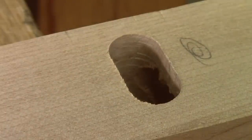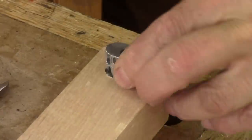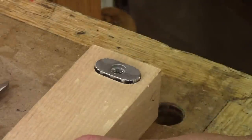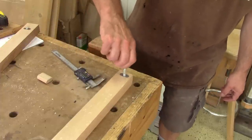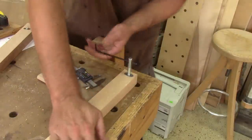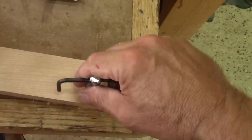Now that all the holes are done, it's possible to put this piece in place and sit it on the bottom. I have to pound this part inside the mortise. This also needs to be flush with the wood. Then it's possible to screw the bolt. The first time, it's much harder to screw because the wings have to bite into the wood. We can use a 10 millimeter wrench or an allen key inside the hole. When I'm at the end, I just unscrew a bit so the big hole is facing the right way.